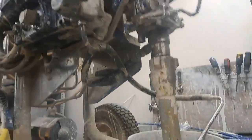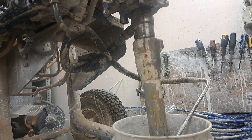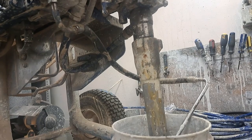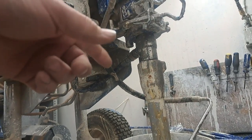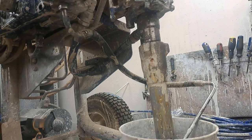The customer says he runs his machine, it tries to build pressure but keeps wanting to miss and not quite build — it continues to run. I brought it in, set it up, and the machine will build pressure but not quite hold it — it dumps it back off. You'll notice it doesn't quite want to stop, and if we flip the prime valve it'll start to run again and you'll see it not quite catch up.